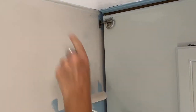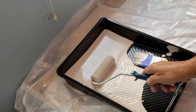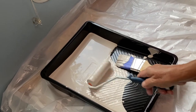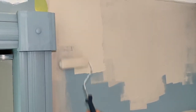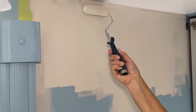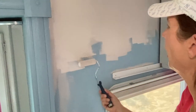If you do all the corners with your angled brush before, again you bring your roller into your paint and roll it so the whole roller is covered with paint. You bring it up and you go up, down, up, down — turn it around when you get to a corner or a wall — easy, no pressure. Bring the paint onto the wall.